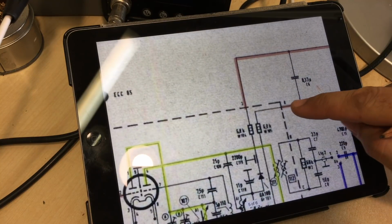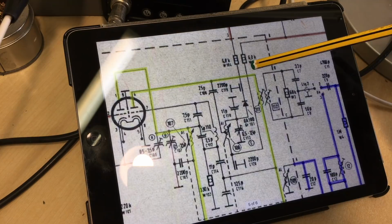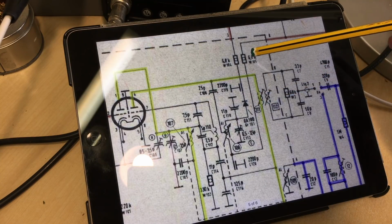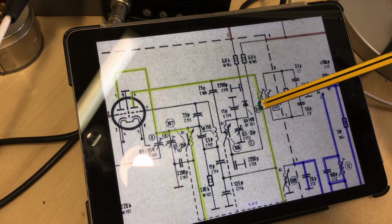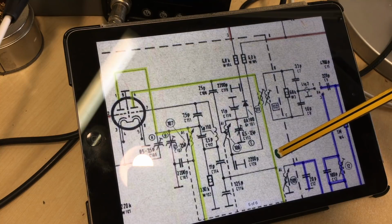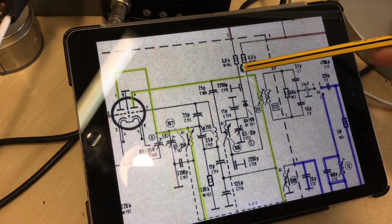What this does, when it goes into the circuit, it goes through two 6.8K resistors. I've measured from there through there, and I get a diode check. But because I've got these two big resistors, I'm not sure that that's real. So yeah, I don't know. This would affect the oscillation if that wasn't coming in properly there.